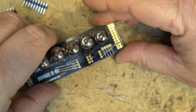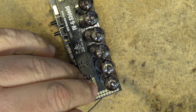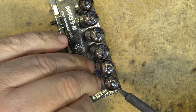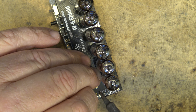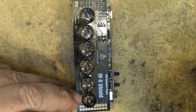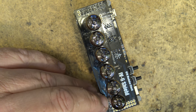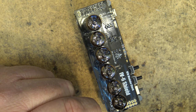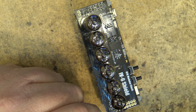You have to count all the pins out, bend them over, and solder them down into the little grooves on the board. Compared to the Numatron where you feed pins through holes and pull them tight before soldering, this is a little harder. Now let's tack down the resistors and complete the unit. I'm also not happy with this Chinese solder I've got — it doesn't flow as nicely as my last batch. The last stuff was 0.8mm and this time I got 1mm — it's a big roll so I'll be stuck with it for a while.